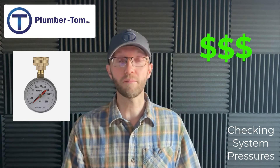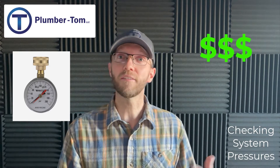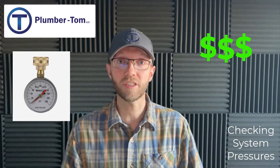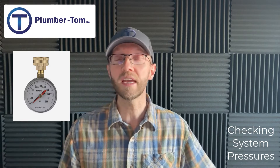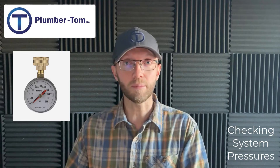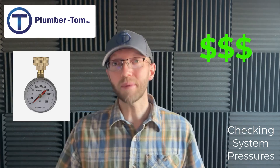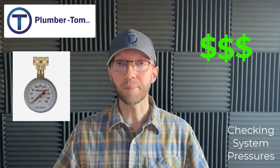Here's the second reason you should do that: you make more money. I have made a lot of money using my pressure gauge to find out the system pressure and then selling pressure reducing valves and, if necessary, replacing expansion tanks. This is not because I like to rip customers off — I'm strongly opposed to plumbers who charge exorbitant amounts for services customers don't need. What I'm talking about is checking the pressure and leaving your customer in a good working situation so their water heater and fixtures last longer. You leave a lot of money on the table if you're not checking pressures and helping your customers in that way.